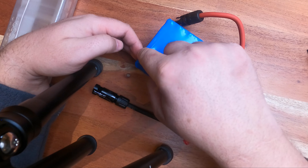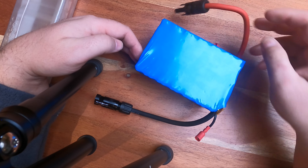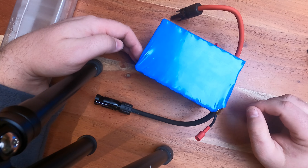Let's assume in this problem statement that the main fuse is not blowing. Then the pack indeed becomes a risk. How does that translate to packs that everybody else is building? Let's assume this is a 24 volt pack - we have 7 cells in series and a few cells in parallel, and you've trace fused all of them. When you have them all trace fused, you have not one wire but 7 leads coming out, and you have your positive and your negative and you can start connecting it.